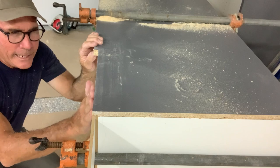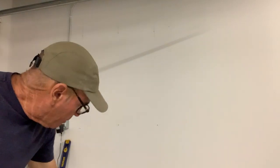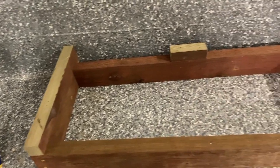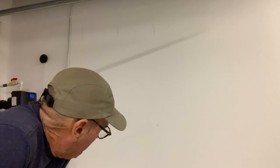Look at that — a nice clean cut, looks like it's supposed to be that way. A couple of things need to happen: you need to really take it slow at this point when you install the cabinet. You don't want to just throw it up against the wall and hope for the best. I've got my toe kick all leveled out and on the wall I've made marks where my studs are and tested to make sure the studs are actually there.